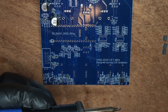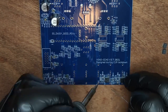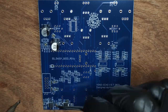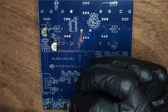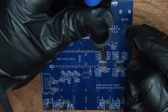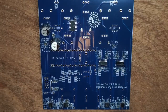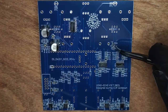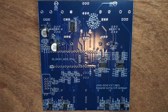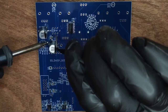Now the 4 op amps: tack down a corner leg, then solder the remaining legs. Use flux to remove solder bridges if necessary. Then the two MCP6004 op amps, the 4051D multiplexer, the little power shunt, and three tiny ferrite beads. L3 is nested between the large capacitors.